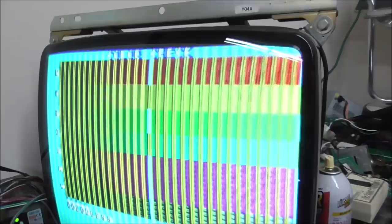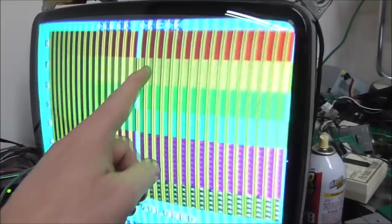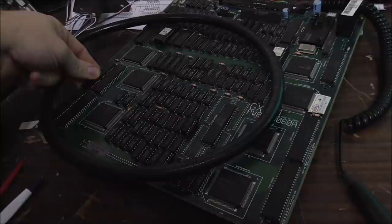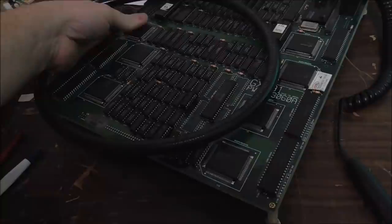Red, yellow, green, cyan, blue — that's an M for magenta, W for white. So I think we've still got a problem. I reflowed this chip here. I think we've got a problem with the board flexing — there's something going on here. It's one of these surface mount chips, maybe. There are some serious flex problems. These things have the feet still on them — they mount in the cabinet like that, and what's happened is somebody stored it like that and put weight on it. Over the years it's cracked something loose.